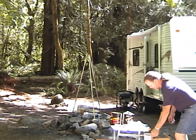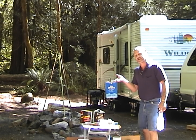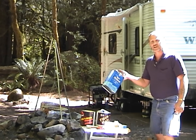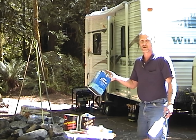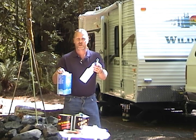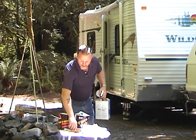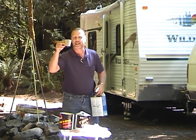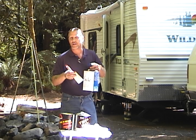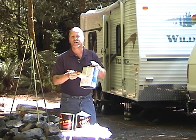The other thing I brought was a can of sealer, which I've diluted already. That acrylic sealer carried in the xylene-based solvent — I've diluted it two to one and put it in a can of xylene just for easy transport because the other can's a five-gallon bucket. What I'm going to do next is pour it into this squirt bottle and squirt the sealer on. Afterwards I'm going to paint brush it in just to make sure I get good dispersal of that material. I'll seal the rock two times. I've cleaned it and it's dry at that point.